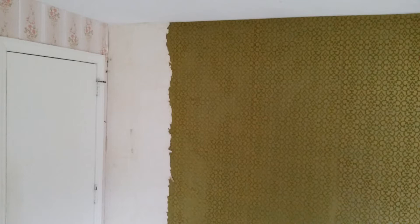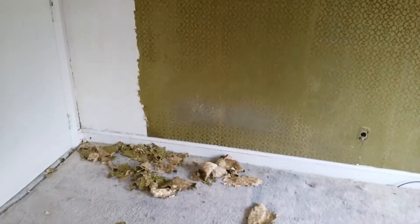I'm going to put this tablet down and show you how easy it is to remove the wallpaper. We're going to start from the top and work our way down. The reason for that is the steam the unit emits will drip down the wall. If you start from the bottom, it's going to drip down and not do any good because the wallpaper will be above you. So work from the top down, and I'll show you the magic of how easy it is through how you hold the scraper.